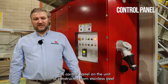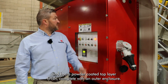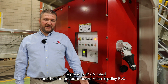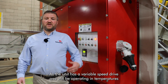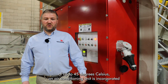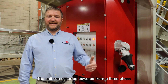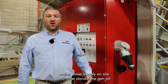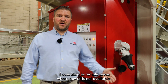The control panel on the unit is constructed from stainless steel and has a powder coated top layer finish complete with an outer enclosure. The panel is IP66 rated and has an on-board Allen-Bradley PLC. As the unit has a variable speed drive and will be operating in temperatures of up to 45 degrees Celsius, an air conditioning unit is incorporated to regulate the panel temperature. The unit can either be powered from a three-phase mains power supply on-site or from a standalone genset if operating in remote areas where power is not available.